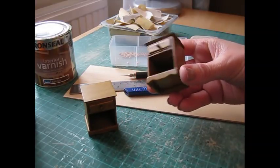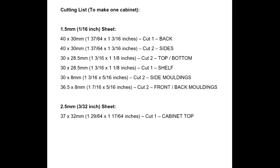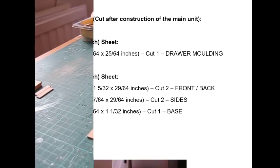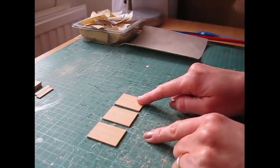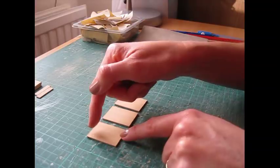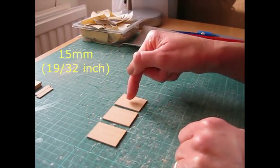I think that's everything you're going to need. The cutting list is coming up next, and then we'll get started. Okay, so begin with your back and side pieces — they're all the same size so it doesn't matter which you use for which. We're going to begin by drawing a pencil line 15mm from the top edge on each of the pieces.